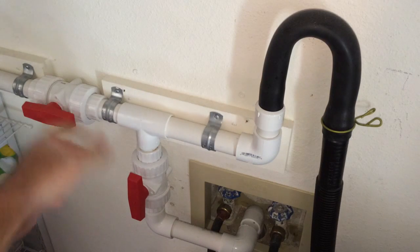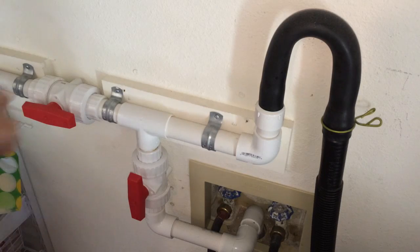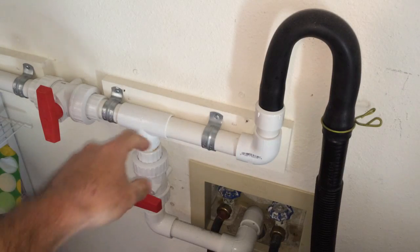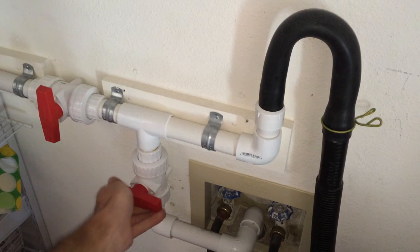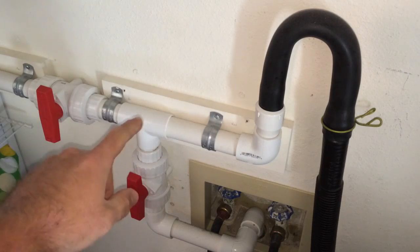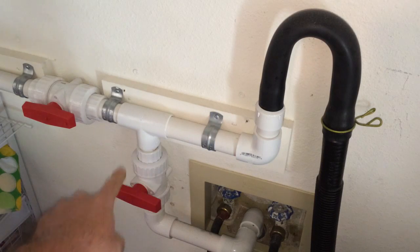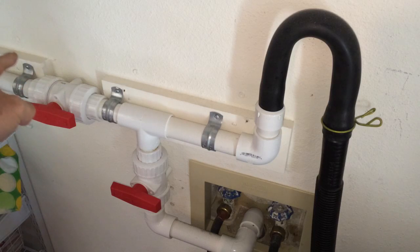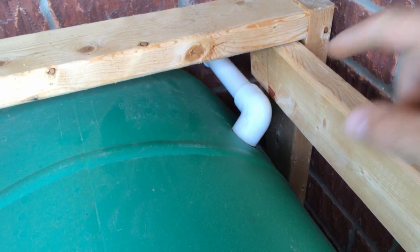What you don't want to happen is your valves like this or vice versa. In this configuration it will actually drain either way, but if you run into a situation where both of them are blocking, you're going to have a backup on your hands and create a big mess. That's just a little trick I discovered when setting this up. If you want to recycle and store the water for later use, you simply turn your valves and the water is blocked from going into the sewer and goes out through a punch through the wall to a storage container outside.